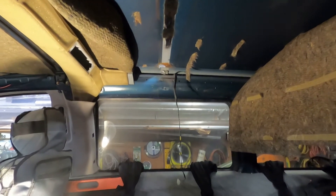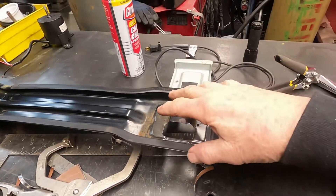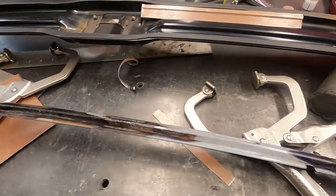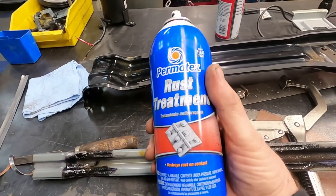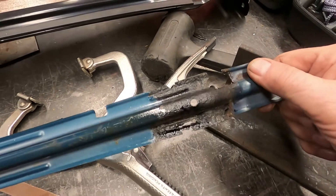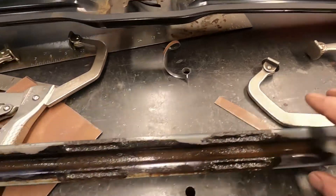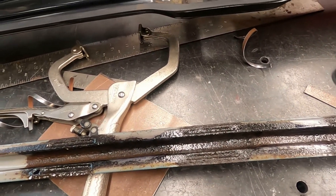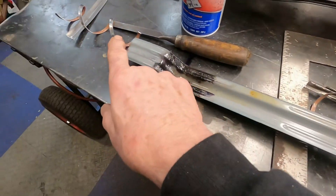Let's go to the bench. This is a structural piece I pulled out — it holds the dome light in place up there, and I literally had to cut it out to make sure I had plenty of room. You can see it's pretty rusted too, turning black here because I sprayed it with rust treatment inhibitor. I'm going to have to rebuild this a bit. I'm not sure how I'm going to handle putting it back together and making it stronger, but I want to put it back up in place — probably use some adhesive. I think this may have been tacked in place and that's why it's all rusty.